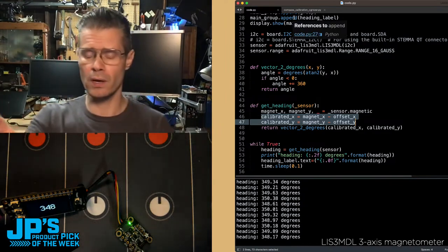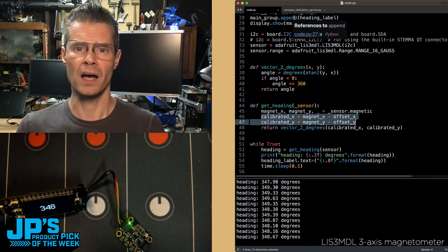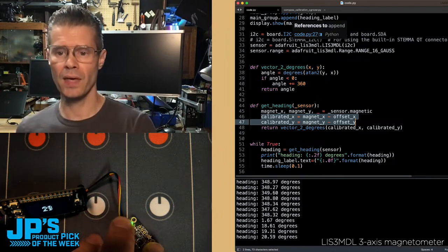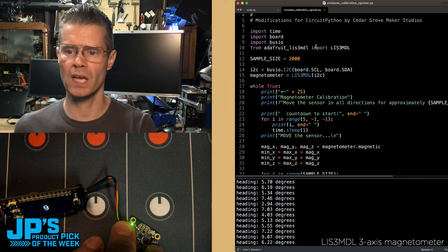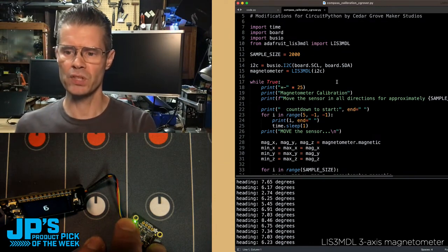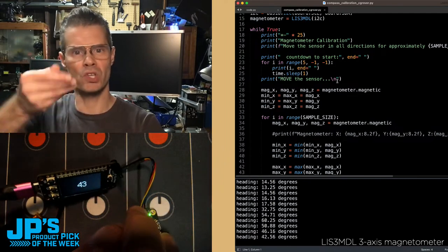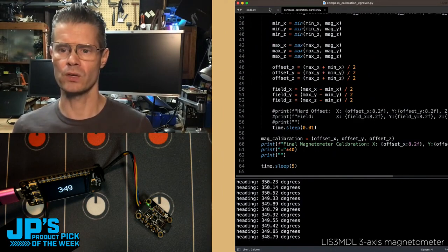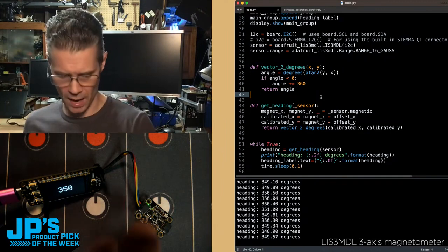There are a couple of ways you can get these offsets, and I'll show you the learn guide in a second. First I used the sensor lab code in Arduino that Adafruit has out there to help you calibrate this. And then later I was able to get some code from C. Grover — he's attributed Melissa up here, but C. Grover did some modifications to this calibration library and he's working on some updated code that hopefully we'll publish and put into the guide. This goes through and takes a bunch of samples and throws away distracting magnets. You do some revolutions on each axis and it figures out the necessary offset to subtract. Then I took those values and put them into my final code. We might work that up into a nice feature where you hit a button to enter calibration mode and automatically subtract those offsets when using it.